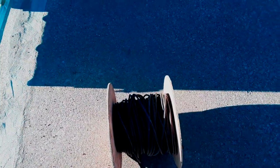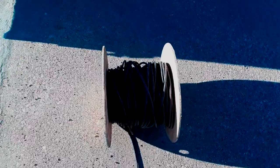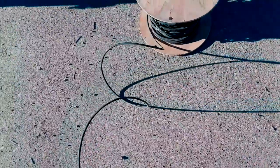I've got the wire on the spool set up. One trick with these — same thing with the seal tight I showed you earlier — you don't want the wire to have bends in it. One way to make sure it rolls out straight is to put it on the ground like this and pull it off the spool. This is only a 30-foot pull so I'm not going to set it up on a rack. One thing you don't want to do is pull it off sideways like this, because it's going to have kinks. The easy way when you're only doing short runs is just push it off like this.